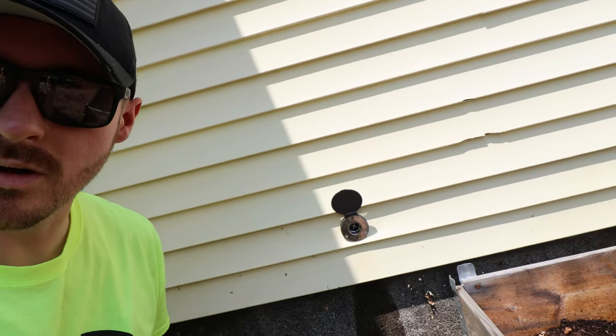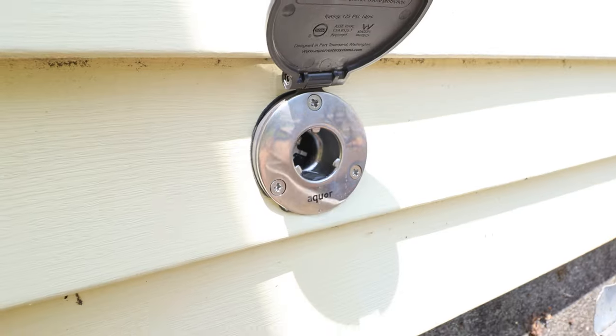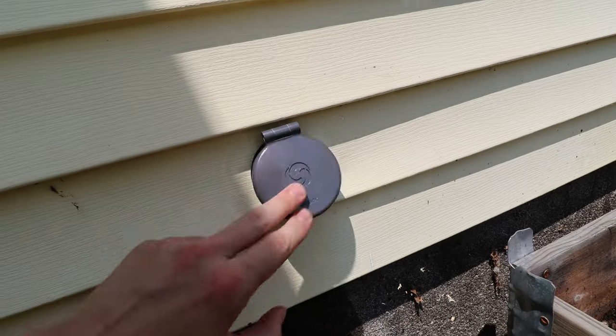That's it — we have our Aquar hose bib installed. It only took a couple hours to install, and it's going to depend on where your water pipes come in. It's pretty straightforward, nice clean setup, and it's relatively cheap — about 80 bucks to do. My one recommendation is that you go with a normal hose and not one of the scrunchy expanding ones, because if you're looking to unhook it and you have a scrunchy hose it's putting pressure back on it, making it harder to grip the connector and disconnect. If you guys have any little house tips or tricks or things you want me to install, leave it in the comments down below. Don't forget to subscribe, and we'll see you next time on Down to the Frame.